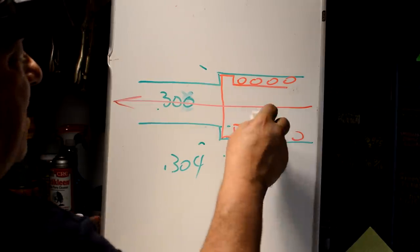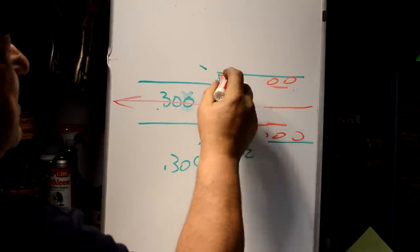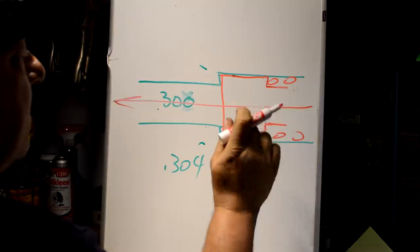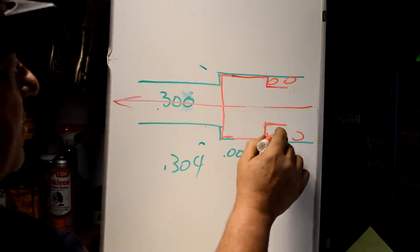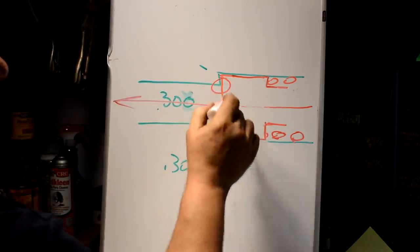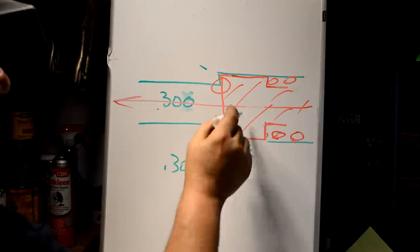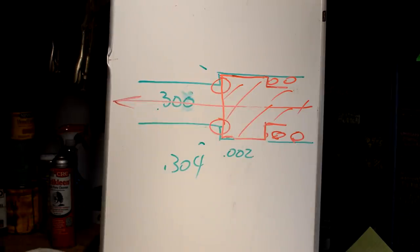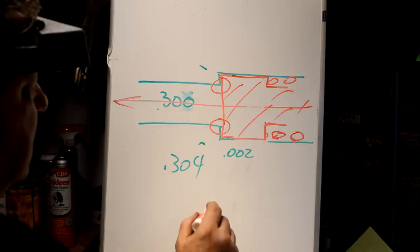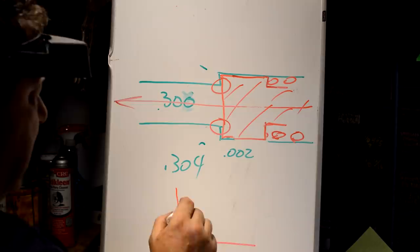The piece that came with the gun that was destroyed — see these two coils I'm erasing right here? — looked like this. That ate up two coils, plus we had to get rid of about one more if you did all the math. Right in here got destroyed, it got battered. It tried to take this piece of metal right here and strain it through that 300th hole like it was a reloading die or some sort of forming press. So what we've determined is we're going to make another piece and make the skirt shorter.